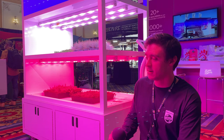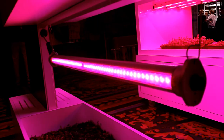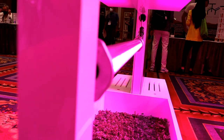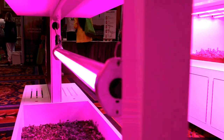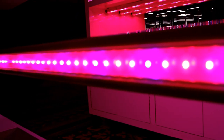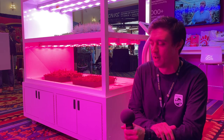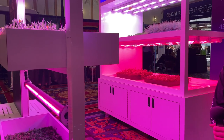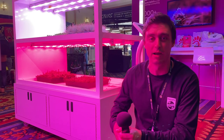This is our interlight here. Philips is unique in that they've offered an interlighting or intercanopy lighting solution to the horticultural market for about 16 years — one of our most developed products, with initial success in high-wire fruit and vegetable markets like cucumbers and high-wire tomatoes. Moving it into cannabis operations can yield the same expected benefits. Cannabis has a very thick, dense canopy that can be several feet tall, and light measurements show we're at about 10% of the PPFD at the top once we reach the lower portion. Using LEDs, we reduce heat output, so we can move lights into the canopy extremely close to the plant without risking burning or overstressing leaves.